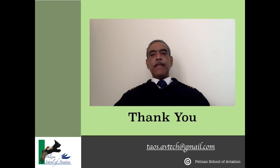We come to the end of the lesson, and we saw the schematic and the general electrical system provisions, load distributions, and the bus bars, and the salient aspects of the electrical system. Now we are going to see, in our next lesson and following lessons, normal operations and abnormal and emergency operations, indications and actions thereof.